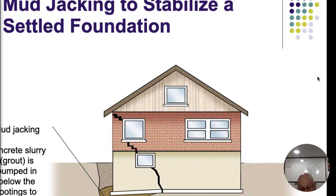With an angular crack following down to the right, the last point of support tells us that section is settling. I firmly disagree with mud jacking as a repair for a foundation with a basement — we don't know where the slurry will go or what it'll fill. For slabs — sidewalks, driveways, monolithic pours for detached garages — mud jacking is a great solution. But not for basements with strip or spread footings.